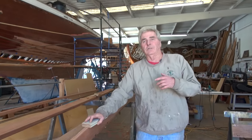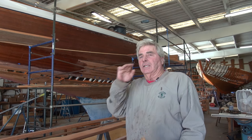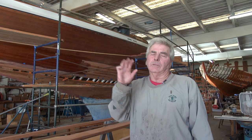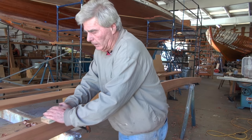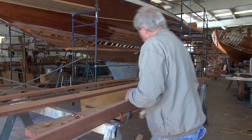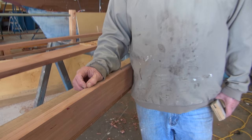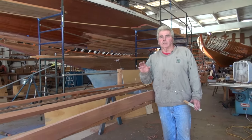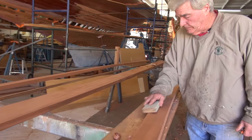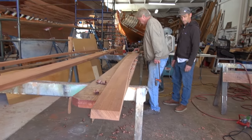When you do the shutter plank, the day before you fit it, you get it cut and ready to go. You put a thin coat of paint on the plank above and below in the opening. That way, when it's going in and you're fitting it, if there's a little bump in it, it'll mark it. That dried paint will be dry but not totally cured. And the shutter plank — you see this sharp edge here? In order for it to go in, you put a little tiny chamfer on there. Like a sixteenth. Just to help it get in — otherwise it'll chew it up. You want it to go in nice but not super tight. Just get rid of any leftover marks. It's really hard to see.